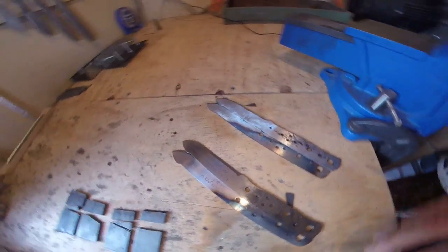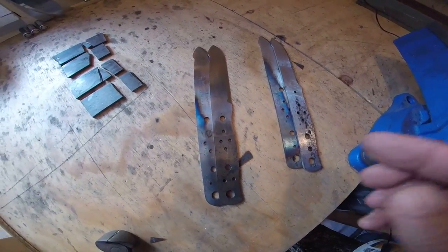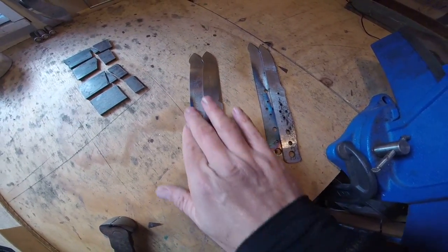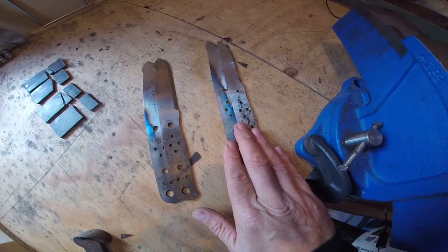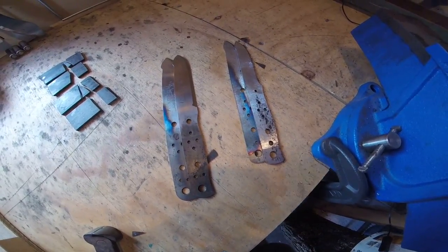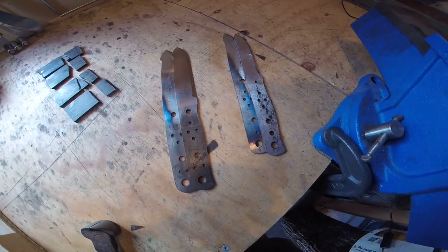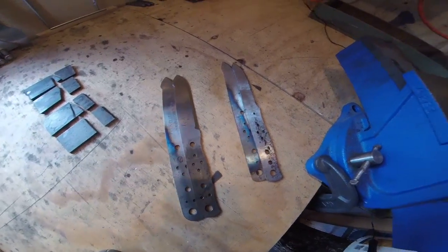The blades which you can see here: two here were just hardened and tempered, and one I've actually done a bit of annealing on the back, a bit of a practice, something new for me. This one was normalised before I did that, but again I've done the same with each set, so they've had the same hardness, but one has been normalised, one hasn't. And out of each of the pairs, one has had a bit of annealing on the back to see what effect that has.